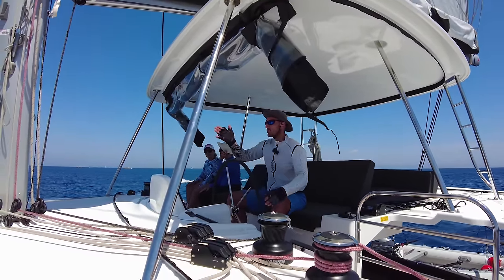So yeah, we could actually have both sails now. The mainsail would help even more, but it's kind of a hassle to put the mainsail up. So many times you would just open the Genoa. It's just way easier. We could open the jib, which is half the size, so it would give much less difference. But because we have this great light Genoa, or code zero as some people call it, we can have this one up because it's way bigger and produces a lot more force.